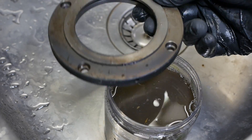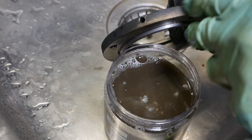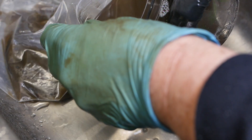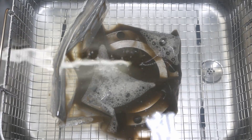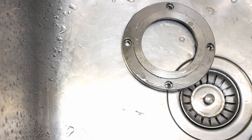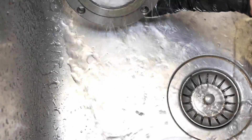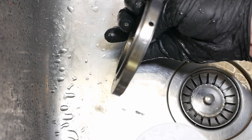Let's step it up to the next level. This is the cast iron back bearing cover from the Schaublin, and it's got this caked-on rubber gunge from the big rubber belt. So I'll put that in a plastic bag, pour in some of that caustic, seal the bag, throw it in the cleaner, and see what comes out. Five minutes later — well, that's cooked. Look at that — came out clean as a whistle! I really thought that rubber would be more difficult to remove, but it came out spotless after just one five-minute buzzing.